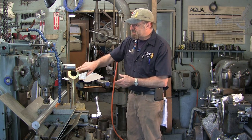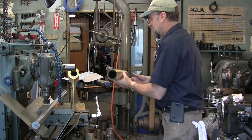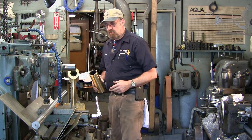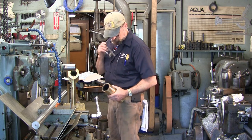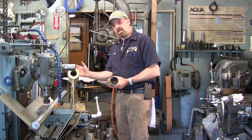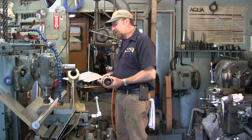And anyway, this is going to have a cutlass bearing installed to it. So we're actually going to be opening this up quite a bit. Its starter hole is about 0.02 over 2-inch, and it's going to be bored to a depth, have a shoulder, and then a minor bore. So it's going to be a two-step boring here.